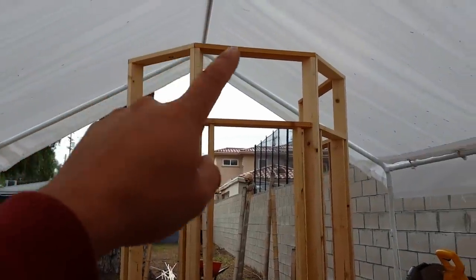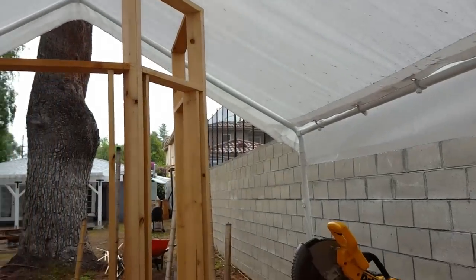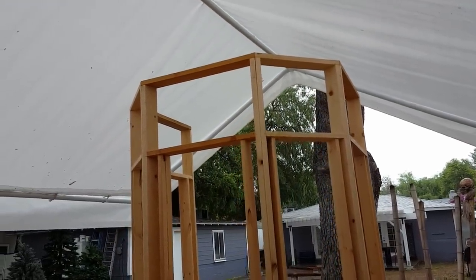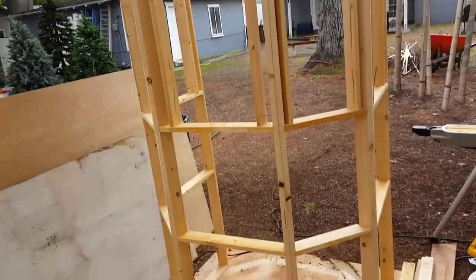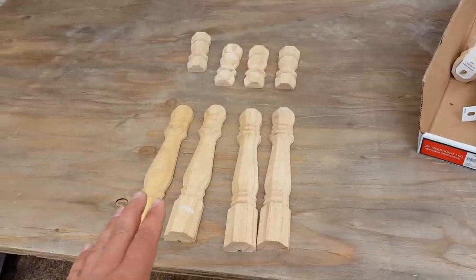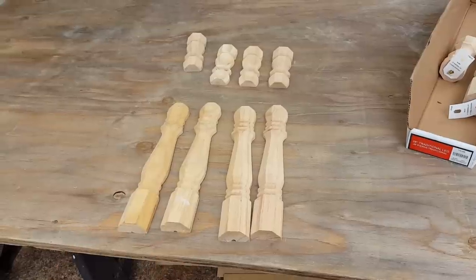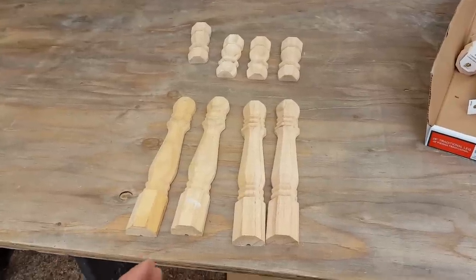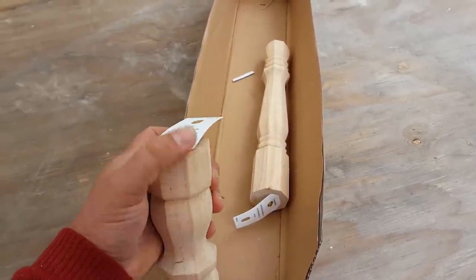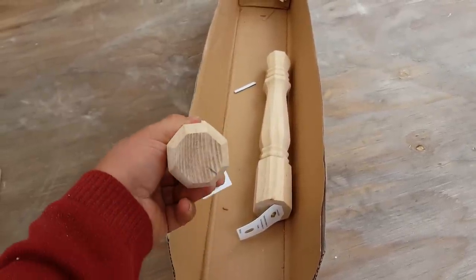The front section is going to have a little hole that you can stick your hand in to get your tickets. On the top we're going to put some crown molding — crown molding is expensive, it's not cheap. We were trying to pick out some cheap stuff, but that's probably the most expensive piece on this thing. We bought these table legs that Gina picked out — she wants to decorate the front of the ticket booth with them. We bought three long ones and three short ones. I need to cut them in half, which I've already done with these. First I need to take some vise grips, pull out these threaded inserts, mark my halfway mark, and then run them through my table saw and cut them in half.